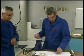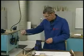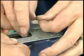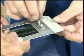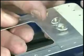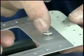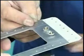So I'll install 2 rivets into those holes that I've pre-drilled and countersunk. I'll get my assistant to hold the doubler while I place some masking tape across the heads of those rivets. Those rivets are nice and flush. Rotate it upside down. Now the spring fits on nicely onto those rivets, like that. And now I place the washers onto these rivets by licking my finger. As if you have a magnetic finger, there the washers are, onto the spring and in the correct location.